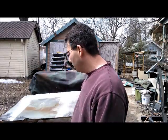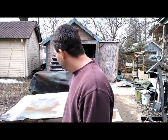And it's lasted well. I've replaced the top a couple of times. Last time I did it, I did just take a piece of 1/4-inch Luan and throw it on there because, well, I had it laying around and it needed a new top, so I just threw it on real quick. And believe it or not, that Luan really holds up to the weather very well. If I had my way, I would have actually built the new table saw out of 3/4-inch Luan.